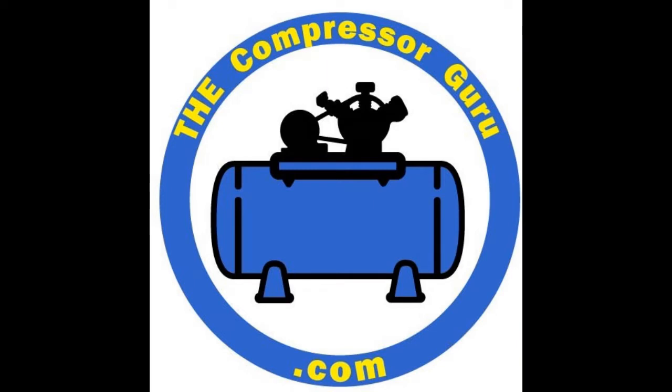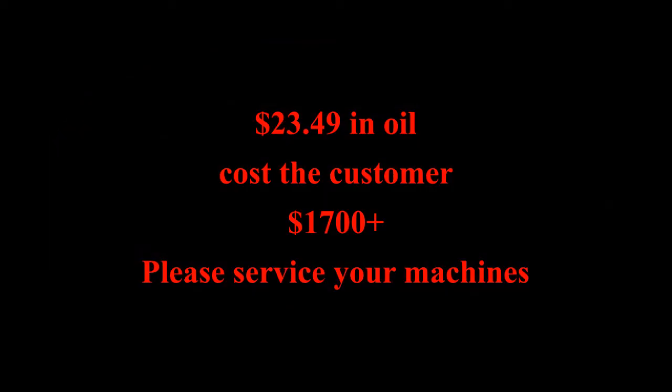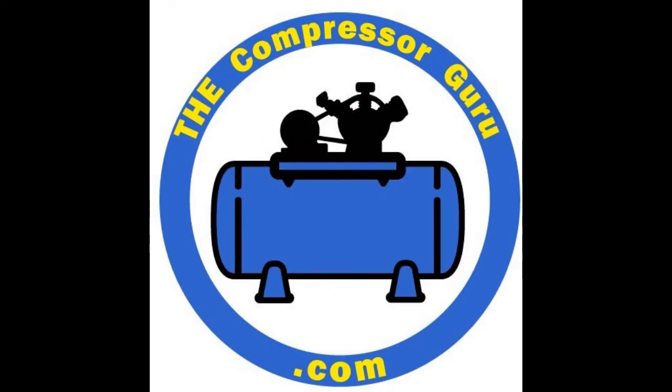After the camera wife, that's me, went home, the guru measured how much oil came out of this pump. It had about 24 ounces of oil, slightly over 50% of the 42 ounces that would normally be found in this machine. The bottom line is, not checking or not changing the oil has cost this customer more than $1,700. The customer has decided to go with a new pump, so we will not be continuing with a rebuild on this particular machine.